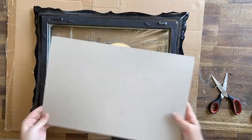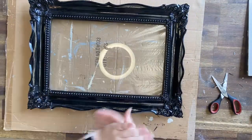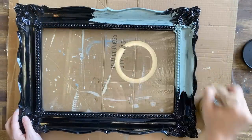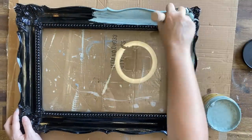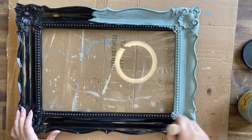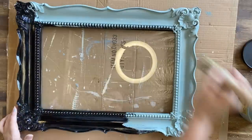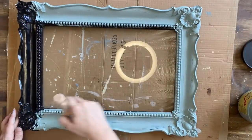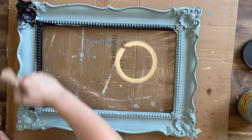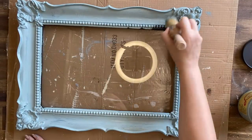Unfortunately the glass of this frame was also glued in, so I'm going to have to just leave that in there while I move on to the next step. I'm going to be giving the frame two coats of Dixie Bell's Vintage Duck Egg chalk mineral paint. Chalk mineral paint is really great to use even on shiny surfaces — it sticks really well. This is a decor piece; if it were furniture and this shiny, I would probably use a bonding primer like Slick Stick, but I'm not too worried.